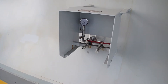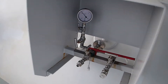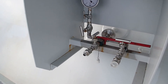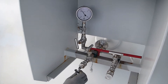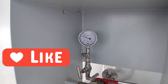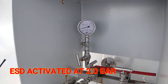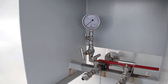So the system has been pressurized again. We will open the manifolds and we will be ready to perform the test from shore to ship. What we are going to do now is place a tool here inside this area in order to pressurize the line and to activate the ESD. We are waiting for the cargo engineer to confirm that all the manifolds have opened. So we have reached 2 bars and the system has been activated. We have had an ESD pneumatic from shore to ship.